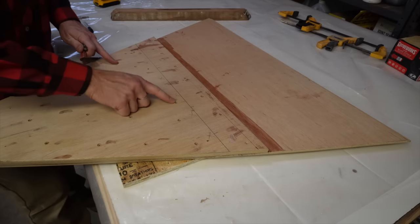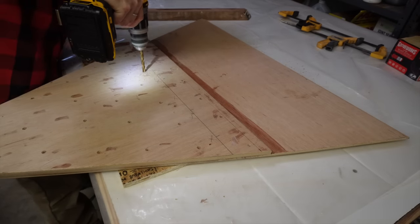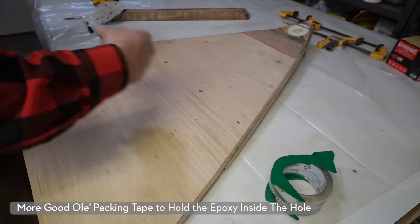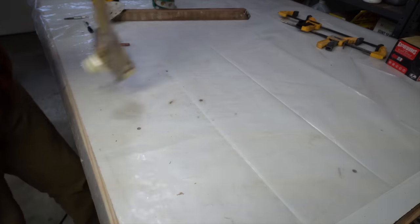So my plan is to just over drill and plug two of these holes to start with. We'll leave the outer side ones until after so that we have something to locate the bar with again to re-drill through to make sure that we get our epoxy plugs centered just right. So we'll use two different drill bits to progressively drill up the sides here.